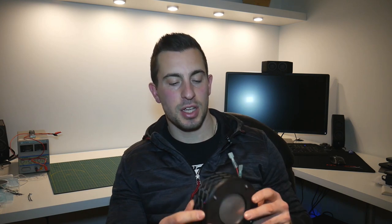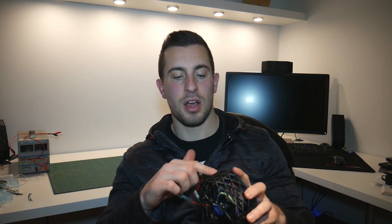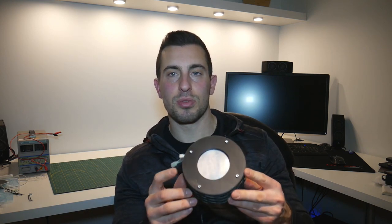That wraps up the drink cooler build. I want to briefly talk about a couple of things I would change if doing this again. First, I'd definitely change the outer casing — I left a lot of room for airflow, but the bottom fan sits almost on the tabletop, so there isn't an efficient way for air to flow into the bottom and through the heatsink. In the design files provided in the description, the outer casing is a little taller to more easily allow air to flow in from the bottom through the heatsink, which should improve efficiency a bit.